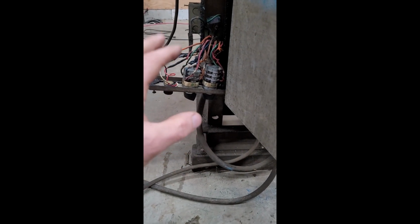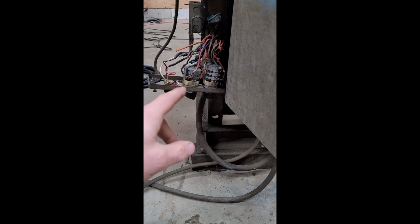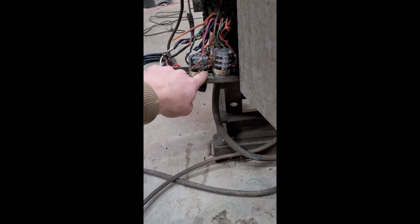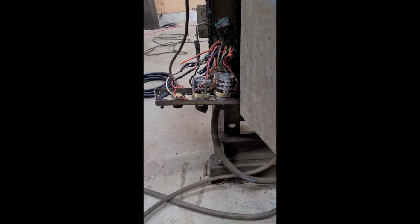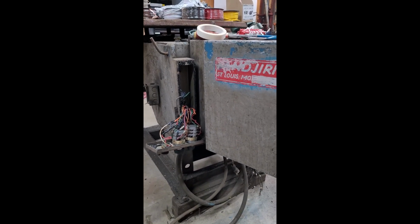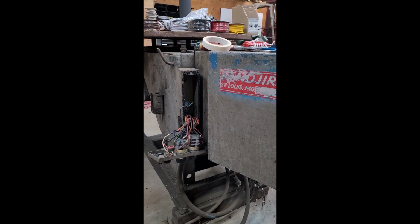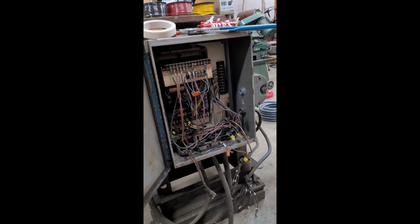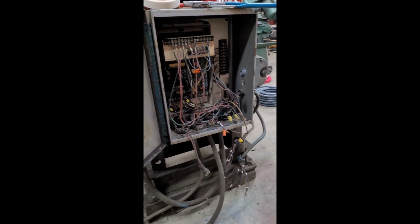So I think that there's some good match up there, but I need to document where everything's going in on which selector switch, because each one has a same 4-3 and an 8-7, and that's common amongst those two selector switches, so I don't want to bugger that up. Anyways, that's where I am so far. I think this one's probably going to take me a little bit longer than I'd hoped. But we keep on plugging away, and hopefully we get this thing running.